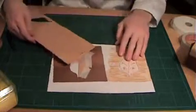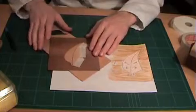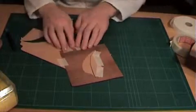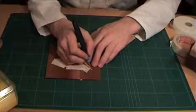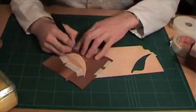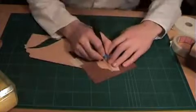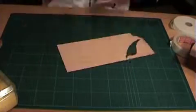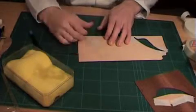At this point you can refer back to your drawing to see which way the grain orientation will suit best. Use masking tape to temporarily hold the waster to the veneer so that it doesn't move while you score the outline — masking tape can be used here because it is only stuck for a brief period, and it must always be peeled off with the grain. We don't use masking tape for all of the marquetry because it can tear the veneer when removed. Veneer tape comes off easily when moistened, and furthermore veneer tape contracts as it dries, which improves your joints.